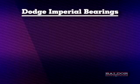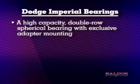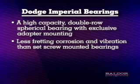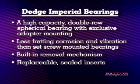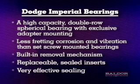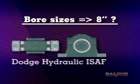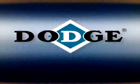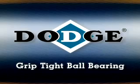As you have seen, Dodge Imperial bearings offer you a high-capacity double-row spherical bearing with exclusive adapter mounting, less fretting, corrosion, and vibration than set screw mounted bearings, built-in removal mechanism, replaceable sealed inserts, and very effective sealing. Remember, if your bore sizes are 8 inches and larger, use the Dodge Hydraulic ISAF with its revolutionary hydraulic mounting and dismounting system. Some additional Dodge videos available for viewing are the Hydraulic ISAF and the Grip-Tight ball bearing installation videos.